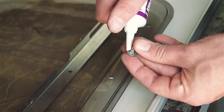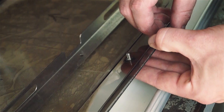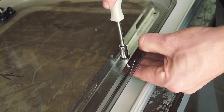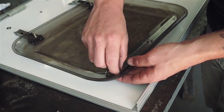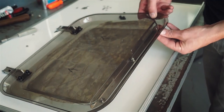Moving to the back edge of the skylight, apply a small amount of silicone to the underside shoulder of a carriage bolt and place it in the center hole of the lens. Next, place the guide bar over the bolt with the long openings facing inboard the lens, and assemble the center attachment point with a large washer, lock washer, and regular nut. Hold the bolt head tightly and snug this assembly down. Repeat this process at each outside mounting point of the guide bar and push the nut covers on.